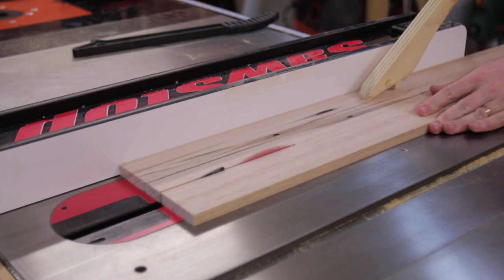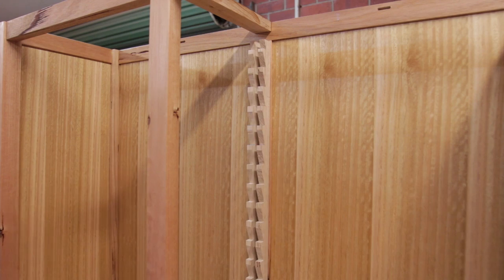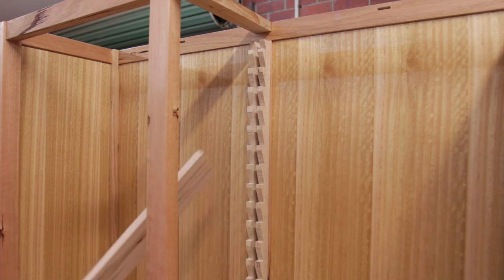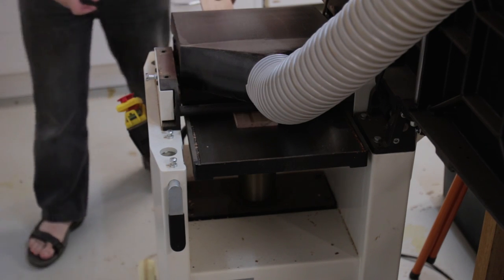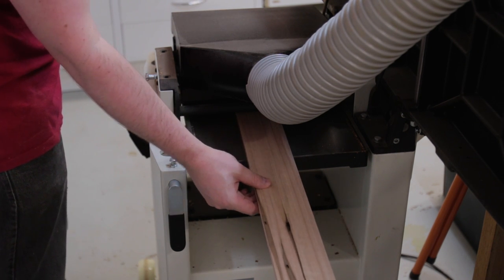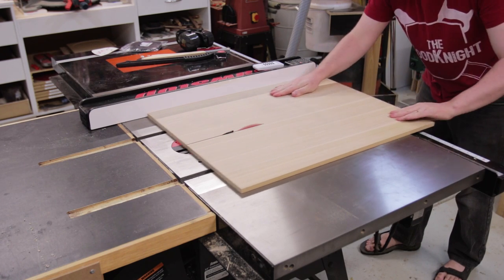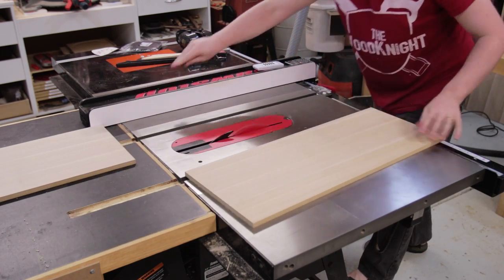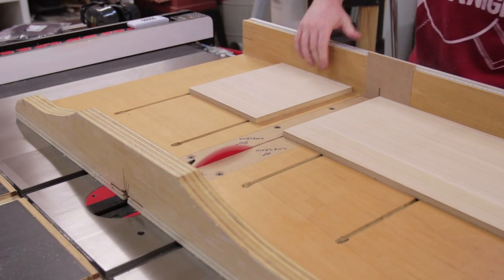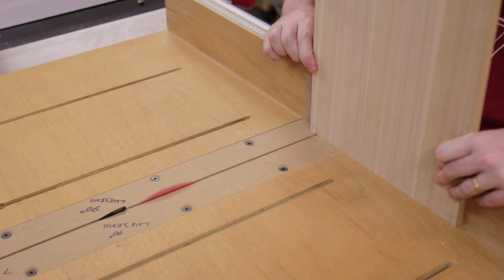I realised that the central plates could be easily knocked out, so a spacer piece to fit between the central standards was cut and thicknessed down for a snug fit. If you make this, you could consider making a single piece all laminated up. A late design change was to add a solid floor or bottom shelf to the cabinet. Because this is going in after the glue up it needed to be two halves to fit in, with a notch to fit around the legs of the cabinet.